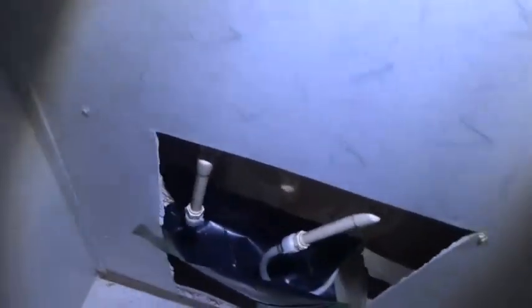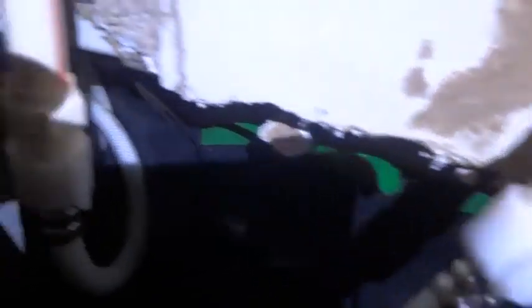Surprisingly enough, it was the cold side — the left one there from the shower. I don't know why these trailers use this line here. It's called Tuf-Line — T-U-F-L-I-N-E. I can't find that stuff anywhere. It's got like a 7/8 inch ball cock connector, like on a toilet. And then it's got them connected down here at the bottom too, as you can see.